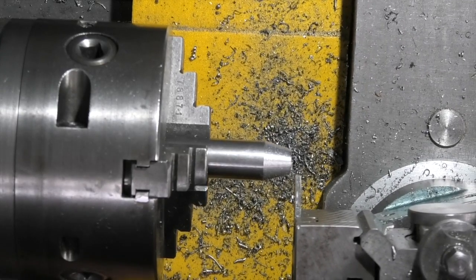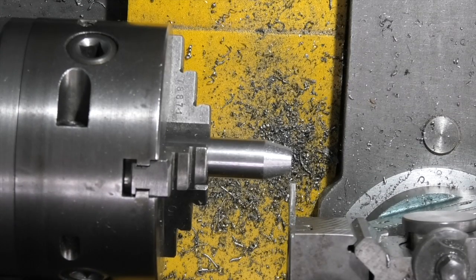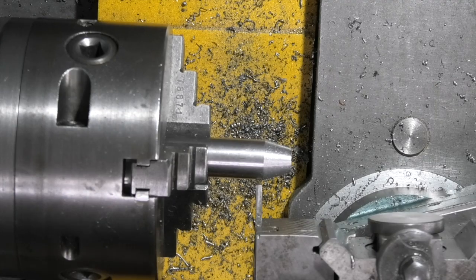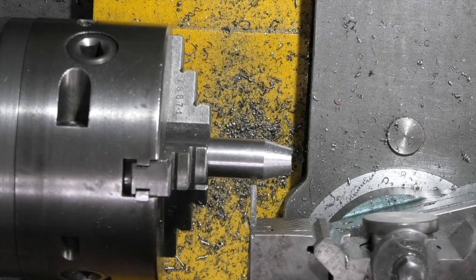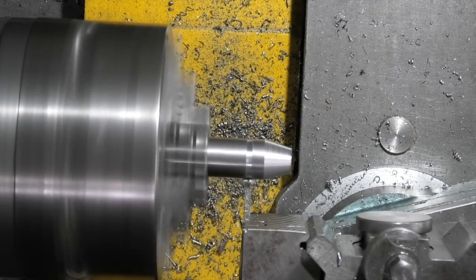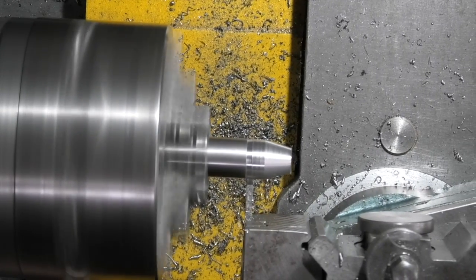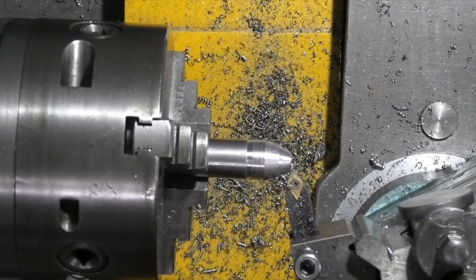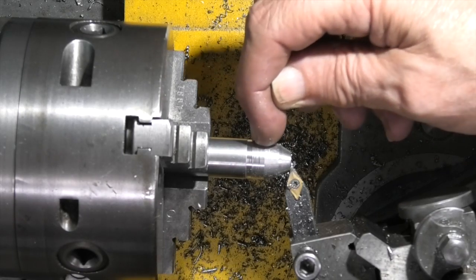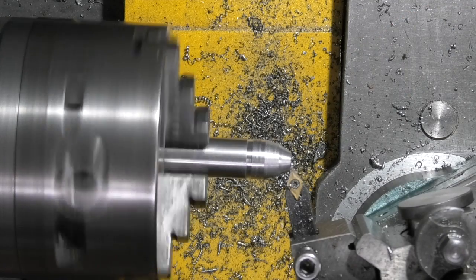I just want to mark the length off, so I put my parting-off tool in and just touch the end, zero my axis, move down the distance I need which is 16 millimetres plus the width of the tool. I've just changed my angle to 30 degrees because this should end at 30 degrees there, and that should be a knurl. This should also come down to the diameter of the rod I'm going to put in - just turning the end.